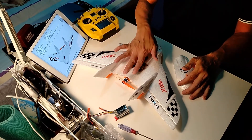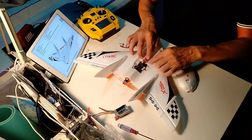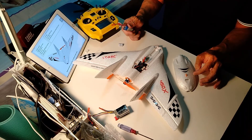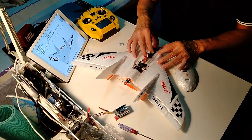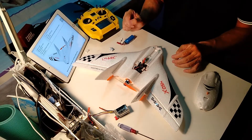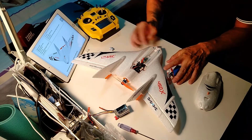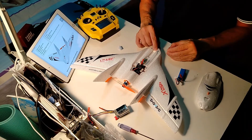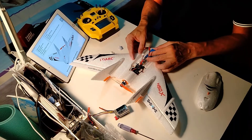Now I have actually glued the cover and the vertical stabilizer on it, and also tidied up the cables, so it's very clean now. This is the battery I intend to use — 2S — and it fits fairly well here. The problem is, with all of this in there, we are extremely tail heavy. We are missing actually about 10 grams. So what I do — you see these little pieces here — I cut this out so that it gives me a bit more space to add weight, and that's where I put my battery.